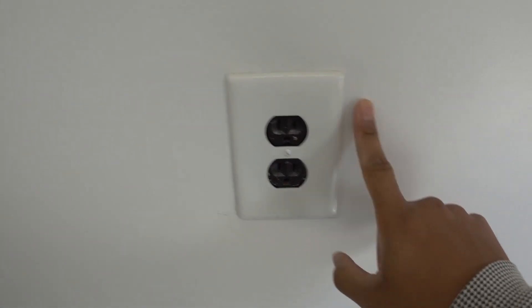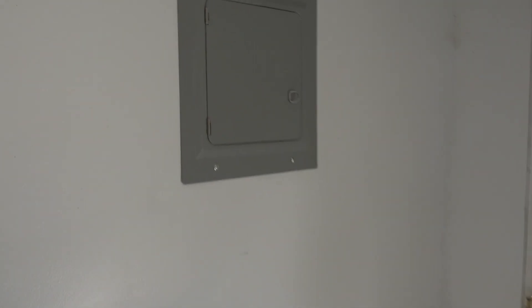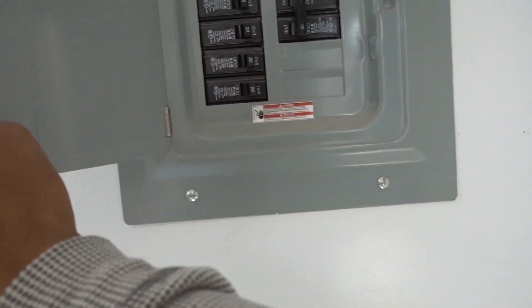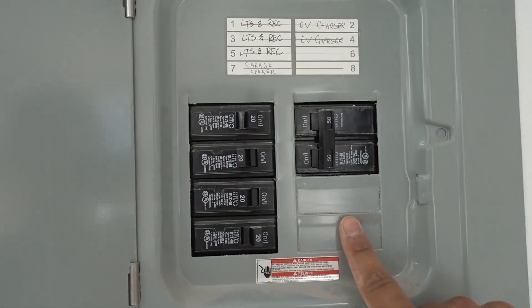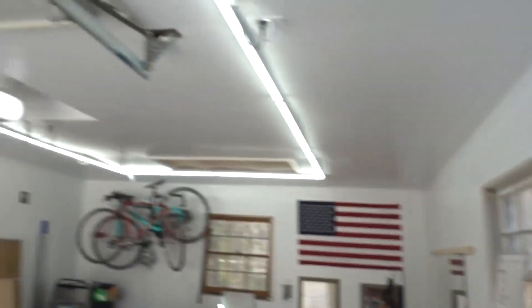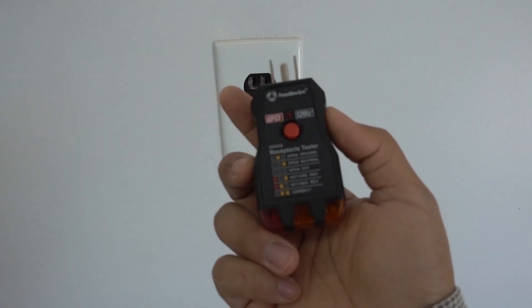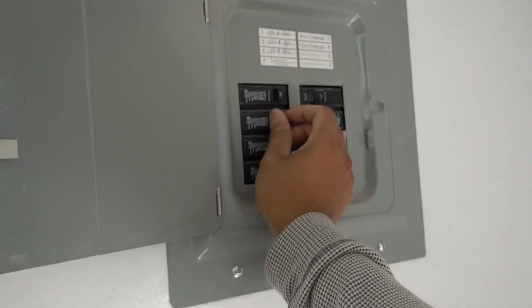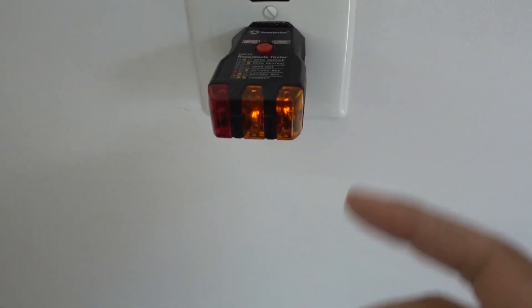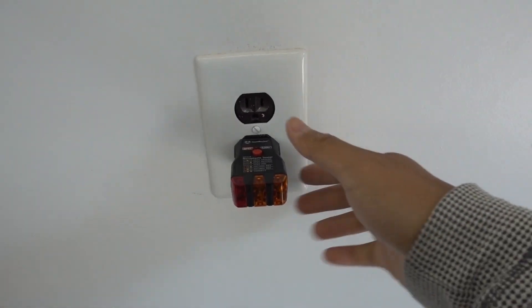Here's the outlet that I'm going to tap into. You can see that my patio is right over there. So pretty much what I want to do is run a wire through this wall onto the other side into that outlet box. First, what I'm going to do is go over to the breaker right here. I know that it's one of these, so I'm just going to turn all of them off. I've turned two of them off — the top ones are actually these lights and I want some light to work with. So these two are off, and I know that this is off because I've got this wire checker. I plug it in and no power. If I turn it back on, the power is back on. So I know that this is the one that I need to keep off, and now I'm pretty much cleared to start working safely.